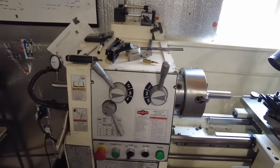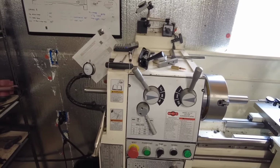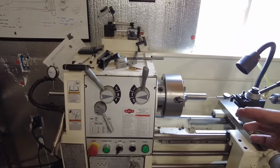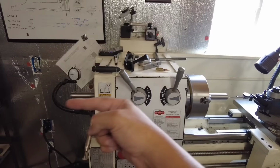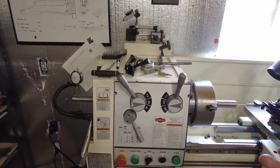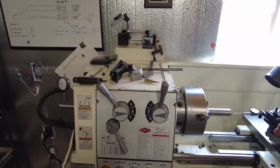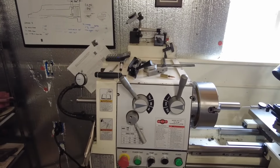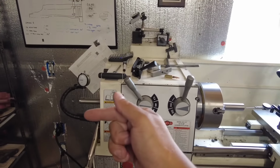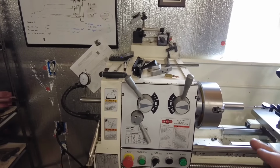Now, this is where prefits and a hand-fit operation are totally separate, and this is the benefit of getting accuracy. If folks don't know, the bore of a rifle is never straight, or it's very rare that it is. There are sometimes barrels that are, for some reason, straighter than others. And 9 out of 10 times, these barrels have somewhat of a curvature. So when they bore the barrel, before they put the lands and grooves in, there is a slight curve.